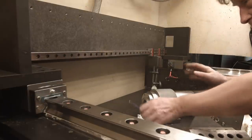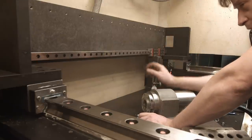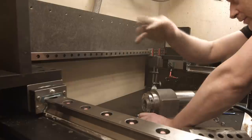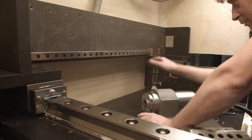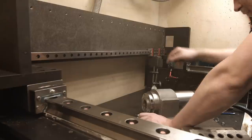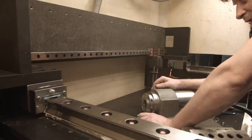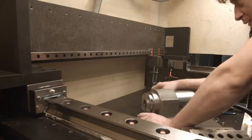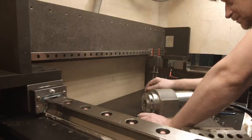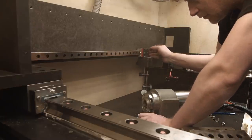So you start with the very few screws spread over, and you doing them up and loosening them up. The rail, usually it's quite straight. And when you're gonna start bolting one screw and, you know, bending it back and forth, you're gonna put tremendous amount of load, because whatever you bend up behind the screw, it will bend down, or at least it would like to. And you're gonna have those zigzags, and you're gonna take tremendous amount of time to straighten it up, and it never will be. So it's better to do few, tighten them up in close proximities to the carriage, and then release some of them, then do them up, and then you're just gonna bolt more of them.